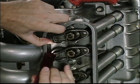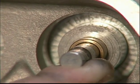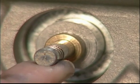It is helpful to use a small inspection light to get a better view. Also look for small amounts of oil being forced out of the valve guides as shown here. This is a normal valve stem and guide.